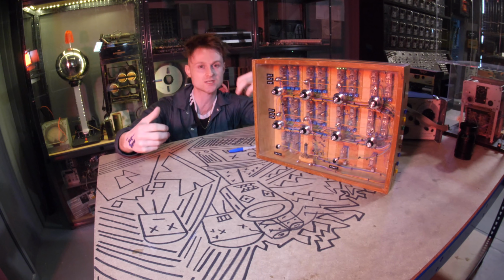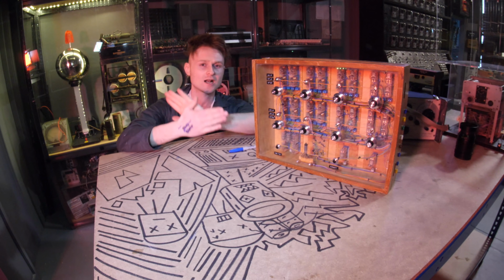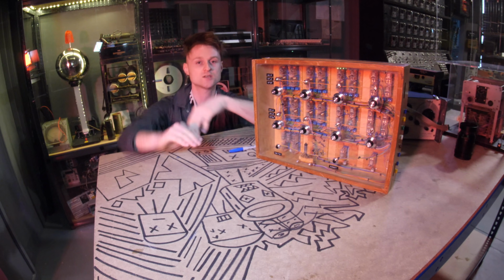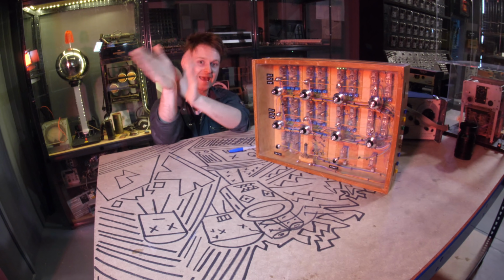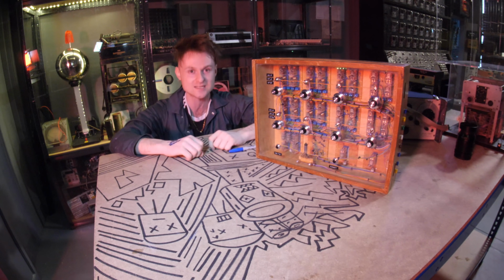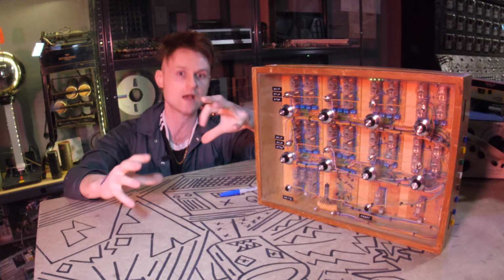The reason it has an interesting sound is because when it's being triggered at a slower rate, it's making a more definite click, and you know, the mechanics is able to move to its destination in time. So it's quite a big clunk, and as it gets higher and higher, the note actually gets softer. That's because it doesn't actually quite get to its ending point, so it doesn't quite make as many clickety-clicketies, and it makes that really recognizable electromechanical oscillation sound.